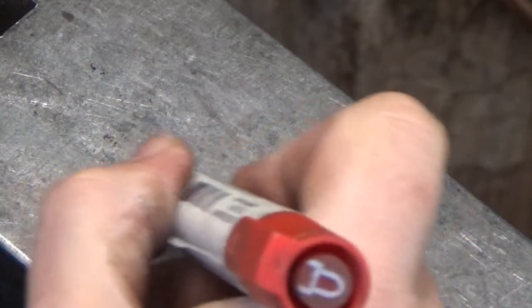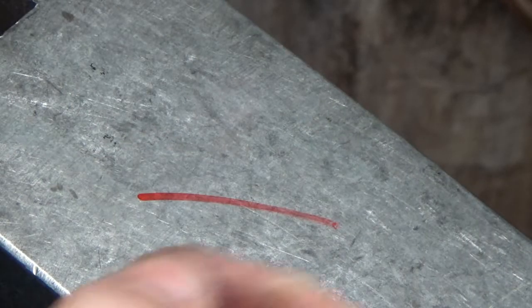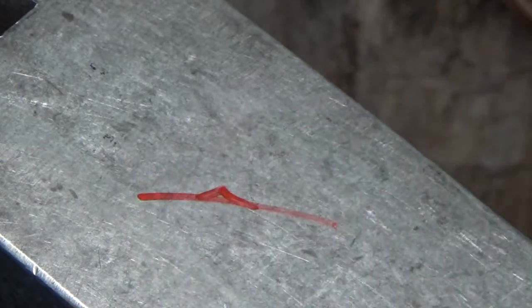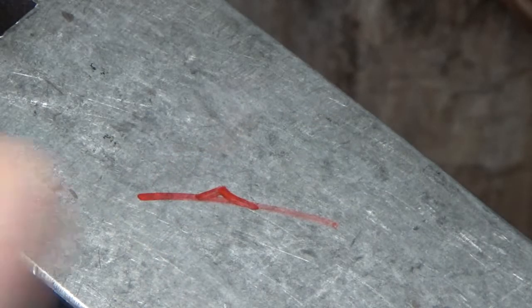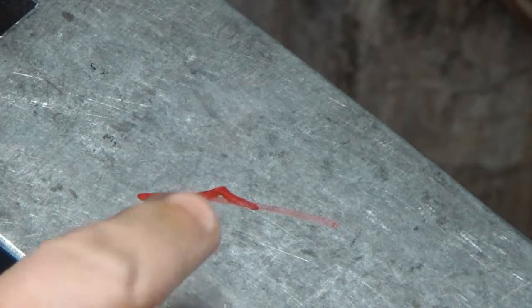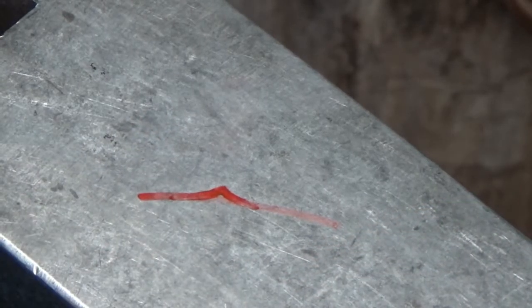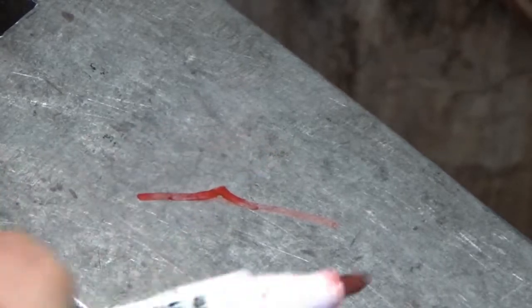In this video I'm going to take a look at how you crease a piece of material. A crease is distinct from a flute, at least in my opinion, in their shape. A flute — if that's your piece of material there — what tends to happen with a flute is that you knock up a shape into it, which can be seen from the front. They vary in shape and size and look, but that's pretty much what they are. You're denting the material. We often dent them a bit too far these days with our flutes, I think.